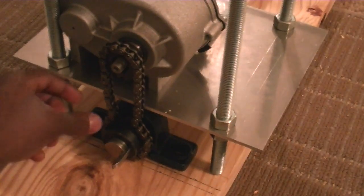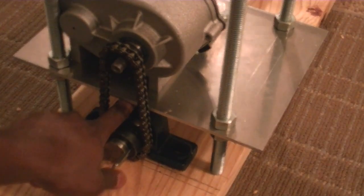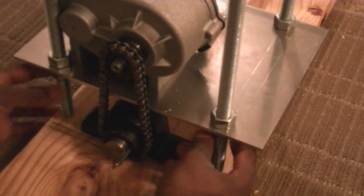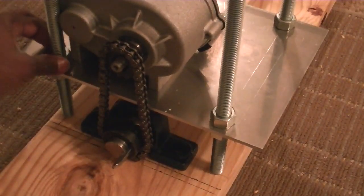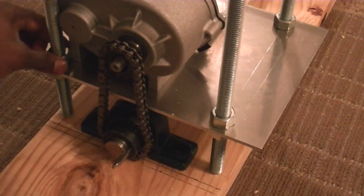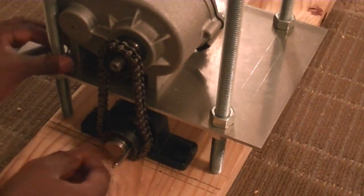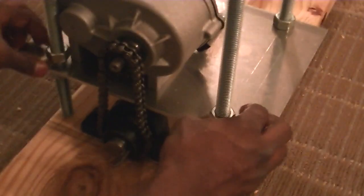I'm about to test it out to see how that works. What it looks like I could do is take maybe one link out of the chain, because from the top of the pillow block bearing to the bottom of this base plate I can fit my finger right there, so I could probably move one of those links. But one thing I noticed is that the nut here is butting up against the leg of this gearbox — I could force it past, but I think I'm going to have to change that out or shave the nut down a little bit.